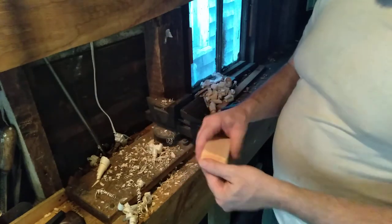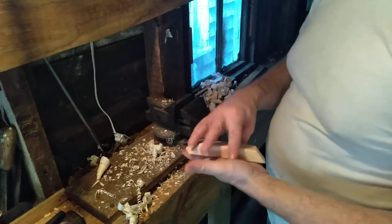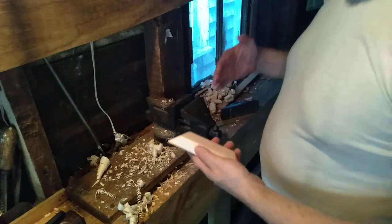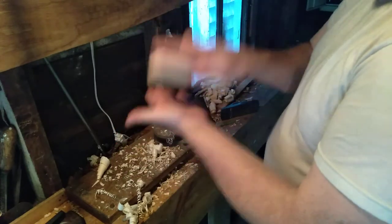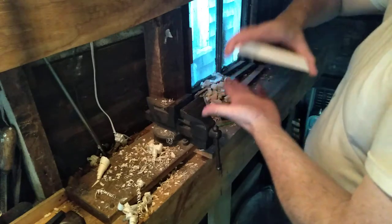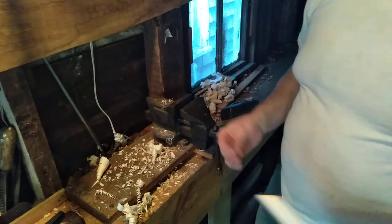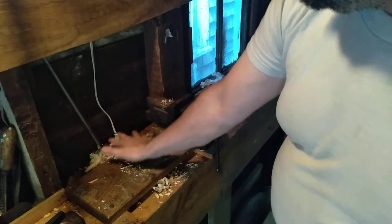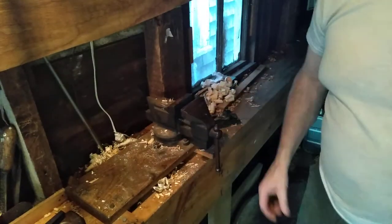It's almost like you're building up a sheet of plywood with these cross pieces, and then the grain running fore and aft on the bottom boards. You're laminating, mechanically, two pieces of wood together at 90 degree angles, so you're getting strength in both directions. It's not exactly the same thing as plywood, but the structure, once it's put together, has a somewhat similar effect.